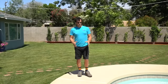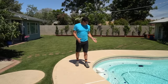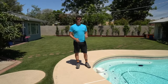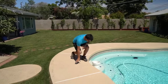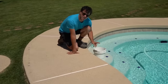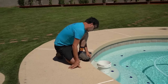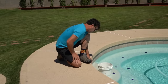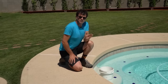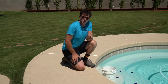So it's been about three days. We've had our bucket in here and our water level shut off. Notice here on the outside of the bucket, I've got a significant loss of water. However, when I look at the inside of the bucket, I see that the level has only dropped down maybe a half an inch. This tells me that we definitely have a water loss somewhere on this pool above and beyond backwashing and drag out from swimming.